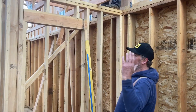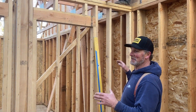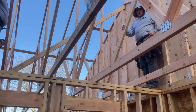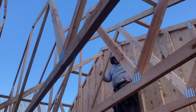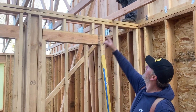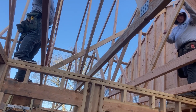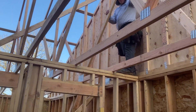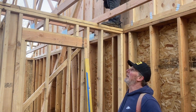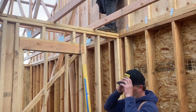It's a calm day, so this is not a big deal, but get these things secured solid. We put a rat run across the bottom cords — the truss is nailed to the wall, the wall is braced, and then an angle from that up to the top of the gable secures the top of the gable. That's it for plumbing this in. We get the other end and we'll have to do the same thing, but now this is going to be holding the rest of the roof. Take your time and do a good job of it.